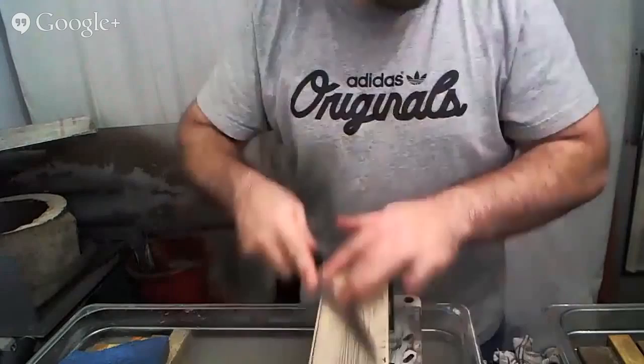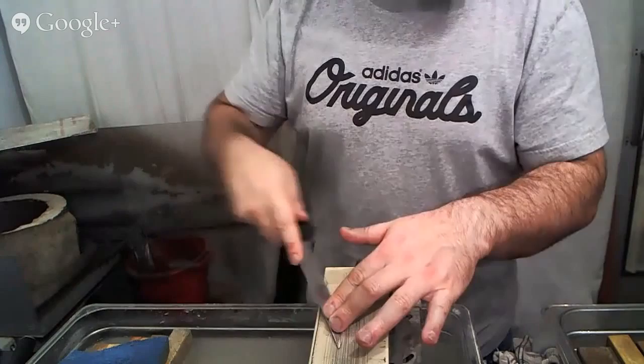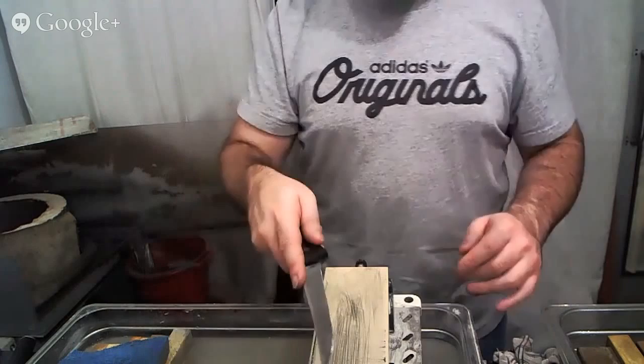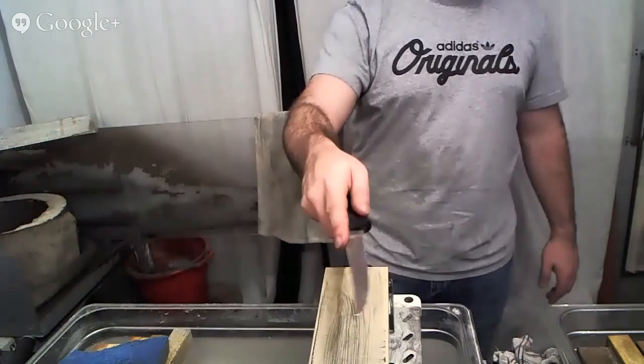So I come out here, and this is me adjusting for the tip here. I'm actually doing the tip sharpening right now. You'll notice that my wrist isn't coming out this way. I'm not doing any of this kind of stuff. My arm is straight forward and straight back. I look like I'm stabbing someone here. Straight forward and straight back, and there's a slight adjustment here. And that adjustment, in and of itself, is going to take care of my lifting up and rotating back. It's just turning my forearm over the tiniest bit. I'm not doing huge adjustments here. It's a very, very small adjustment.